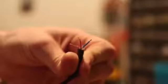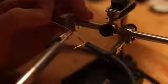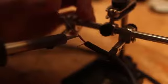Then you're going to want to clip the excess cable insulation. After that, strip the two conductors so there's about maybe an eighth inch of copper showing on each one. Then you're going to want to tin all of your copper — tin the ground wire and the tips of the two conductors. This process is basically heating the wire to the point where you can melt solder onto it and it has a tin look to it, which makes it easier to solder to the plugs.